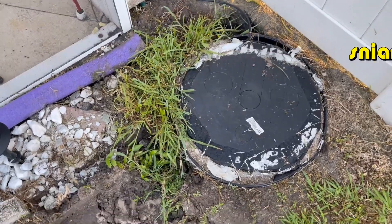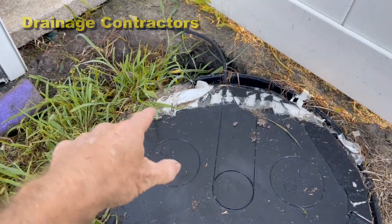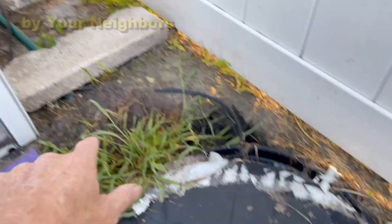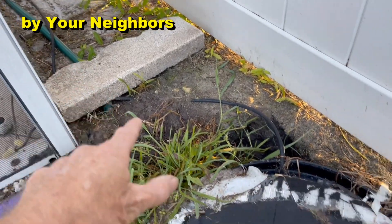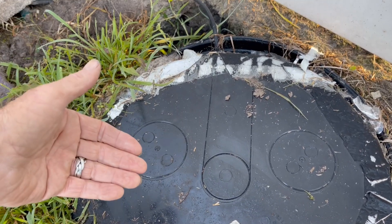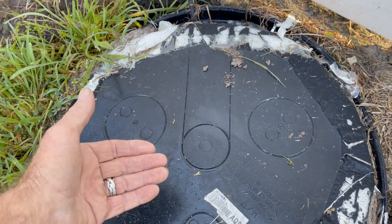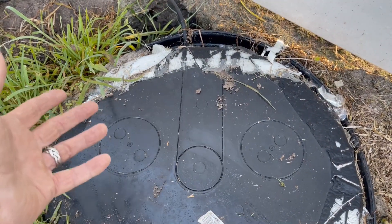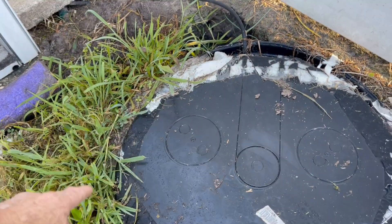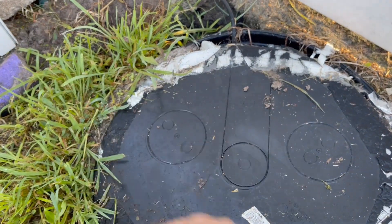You can see right away there's some erosion taking place here on the sides, and I would imagine that the homeowner has drilled some holes into the basin to allow that area back there to drain. What happens of course is there are holes here in the side of the basin, and water is pulling that sand down into the basin. The pump actually works great and it's sending it out to the street — that's not a problem — but the erosion will continue to take place unless we can get some type of fabric to keep that sand from coming into the basin.